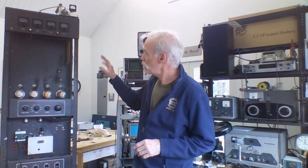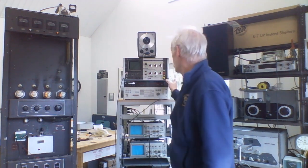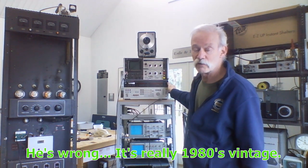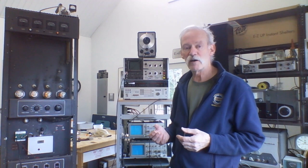That's the state of the project right now. I've cleaned it up, I've tuned it up, it's operating on 1550, which is one of its original broadcast frequencies. Just yesterday I got the buffer amplifier hooked up, and I've been able to power it off of my VFO — which is really a 1960s vintage Hewlett Packard selective level meter. There's a tracking generator output on that. I fired it up yesterday, brought it up to a full 250 watt carrier, modulated 100%, and from here on I'm going to retune it and get it operating on 160 meters.